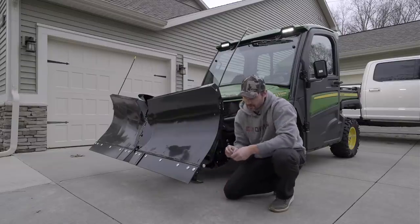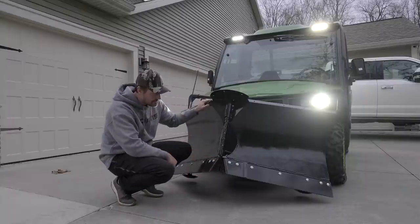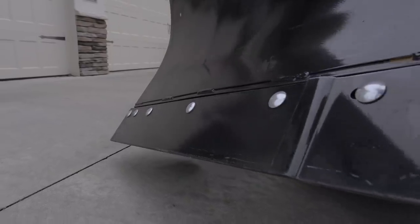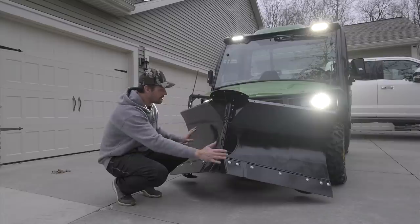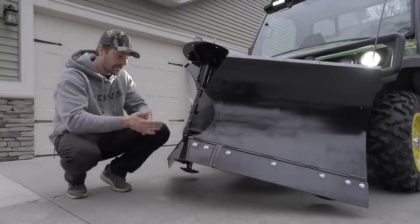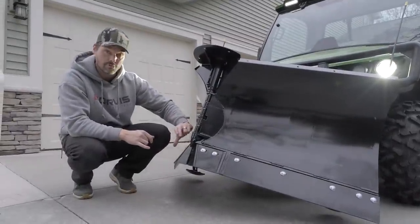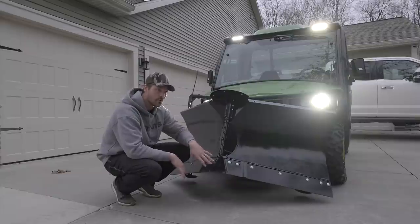Being that this is the first time using this plow, I may have to adjust the skid shoes a couple of times to find that right sweet spot. I do want to put one of those UHMW poly edges on there — they protect like rubber but cut like steel — so it's going to be a lot safer for a paved or concrete driveway. My challenge is this is not just a simple straight blade plow — it's a V plow, and I have to take into consideration the geometry when it's flat, but also an open V and a closed V. I'm struggling with how to configure this center area because I don't want it to bind up or crack if it overlaps. I'm almost thinking I get the UHMW poly as close as I can and somehow find a little flexible rubber piece for the middle on either end, so it still picks up the snow instead of leaving a windrow right down the middle.